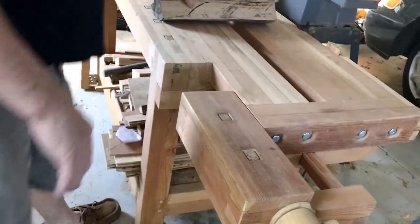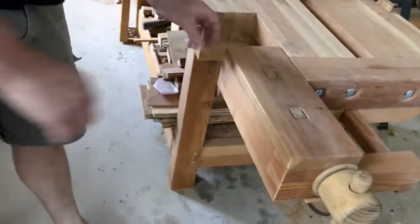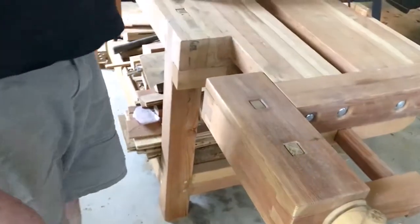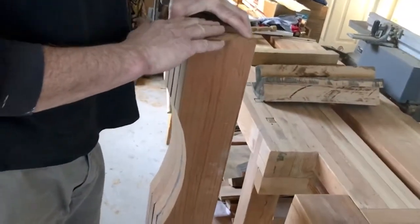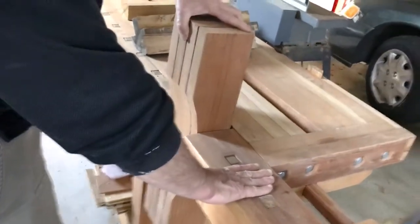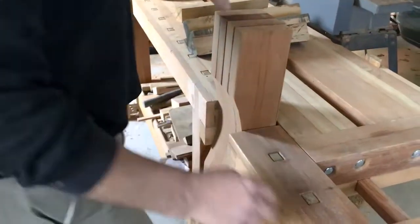Let's talk about having a tail vise versus some of the other vises you see that are really just there to push bench dogs. I prefer the tail vise. You can see the throw and range of this vise — I have four two-by vice sticks just clamped together; this is going to be an outrigger for a house. You can see that I can clamp these in here, even without the lid glued on. Just a simple twist of the vise and this is in there.